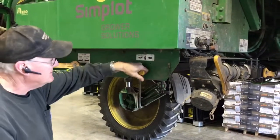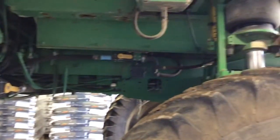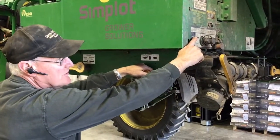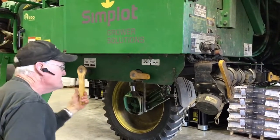Back to bypass, turn it on — that same 25 to 30 gallons, because that's a 100-gallon tank, and that gives you roughly three 30-gallon rinses. You let it go until you hit 30, then you stop. Then you've got to remember to turn this to solution tank.